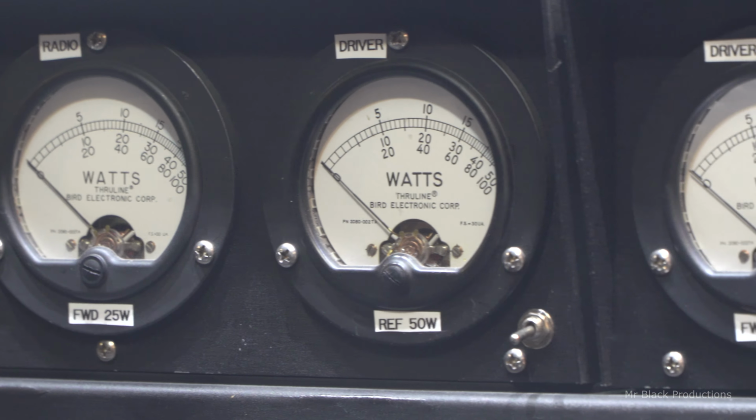So now, I don't know about you guys, but I'm going to install $15,000 worth of radio gear. Why would I trust my ground to the motor and the Volvo company? What size motor is this? D16 600. It's a 600 horse. Yeah. And I wouldn't trust their wiring and their crimps and their connections for nothing. So we went ahead and created a ground out of 1/0, and we took the whole bracket apart and polished the metal in between the frame and the nut and cleaned this all up, and then we cleared it.